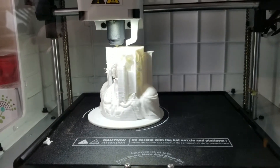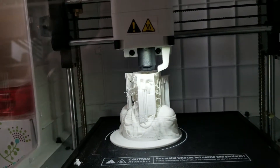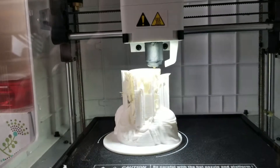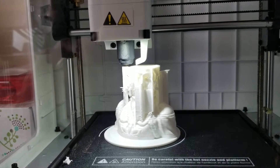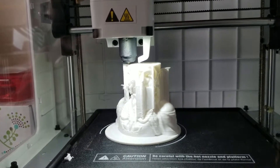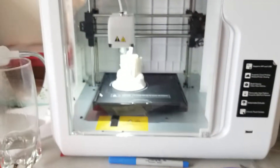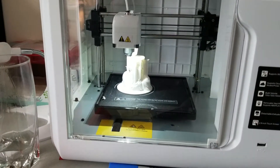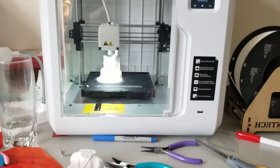This is pretty intense, so I just wanted to point that out. I'm liking the quality of what I'm seeing, so I'll clean it off and show everyone what it looks like afterwards. It looks like I was just missing the mark with the temperature I was printing at, and that is a huge deal. It turns out 10 degrees or 5 degrees Celsius is a big difference — not the same as a 5 degree Fahrenheit change, for anyone who primarily prefers Fahrenheit.